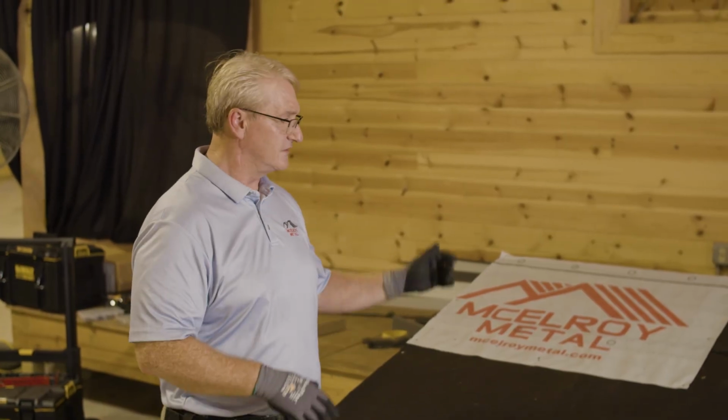One thing we wanted to talk about, we get customers asking, hey, do I put on ice and water? Do I use regular 30-pound felt? What do I do to apply, and get my roof ready? The answer is, it depends on code. You have to follow your local code. Where I live in Michigan, it is a 2-foot inside wall.